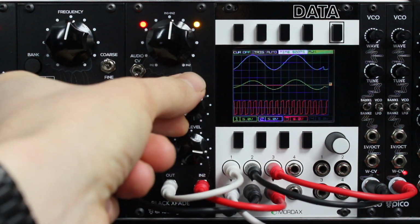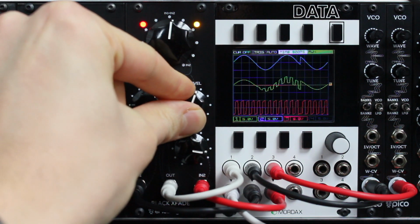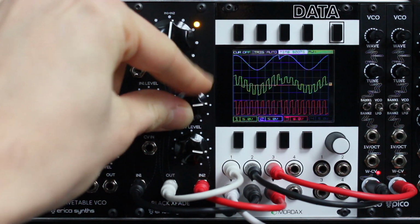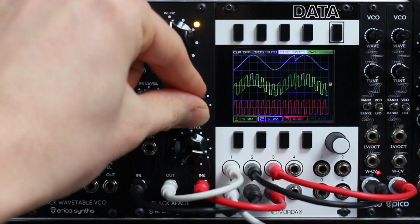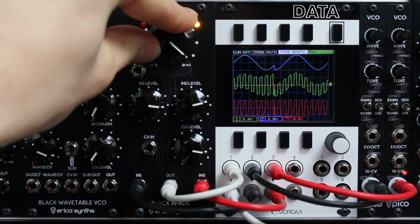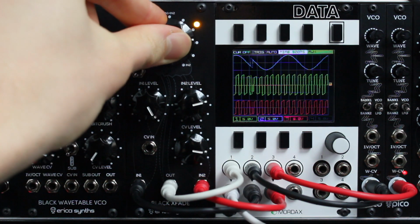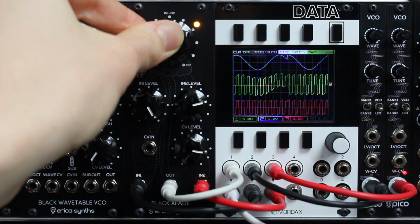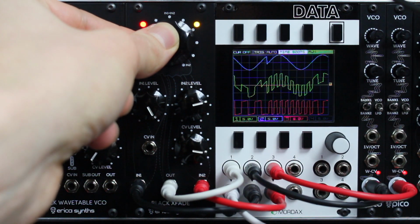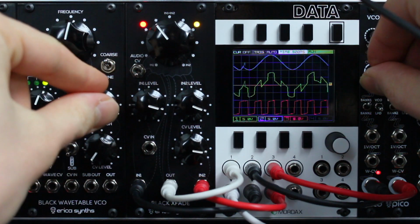The mixed signal of the crossfade module is then patched into the Polivoks VCF module and is controlling the filter's cutoff. I will now play around with different gain and speed settings, but will keep both LFO waves the same. As you can see, by mixing just these two simple LFO shapes, you can already achieve very interesting modulation signals.